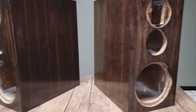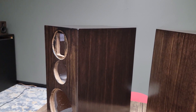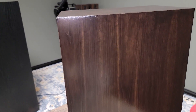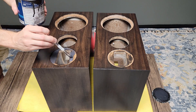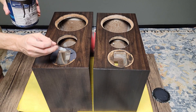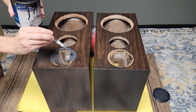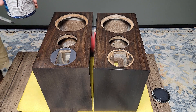The poly that was on there before was very yellow and amber and really darkened it up a little bit, so this satin finish really shows the wood grain and just lets it really pop and do its own thing. This next step is a little unnecessary for this kit just because the recess is so precise — it doesn't need any black paint to hide any sort of reveal — but I'm going to go ahead and do that while I've got it apart. It's always a good idea.